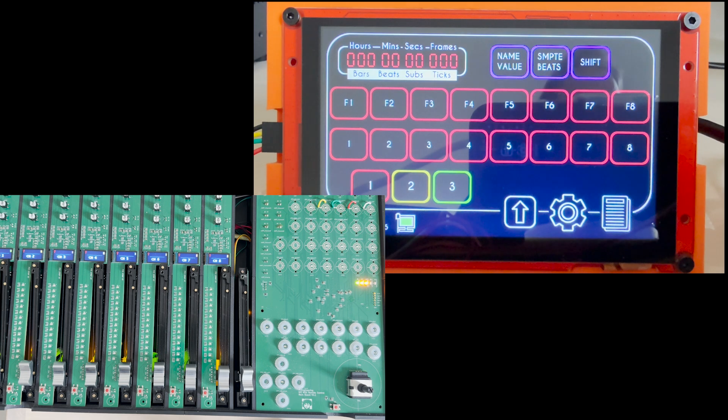This implies a series of processes that must move not only the software but also pointers to certain parts of it — mainly the vector table and the reset handler. For the STM32H7 this wasn't that complicated because the H7 is a quite modern and capable MCU with a lot of features in the HAL framework that make these operations easier. For the STM32F0 inside the channel, the situation was much more complicated — it doesn't work the same way, and moving the pointer to the vector table and reset handler requires a series of more complex operations.